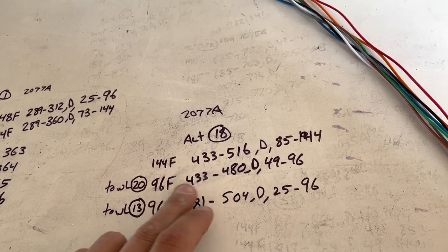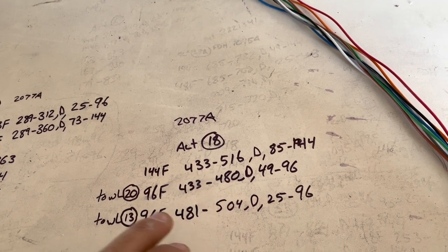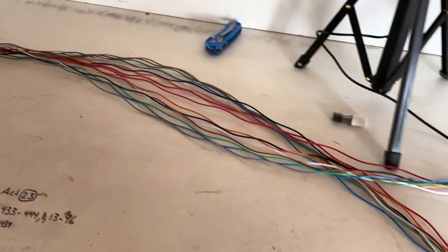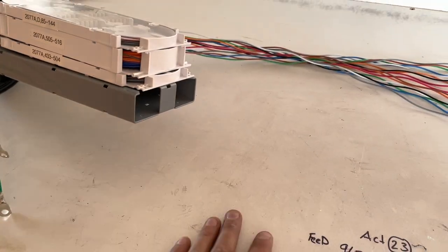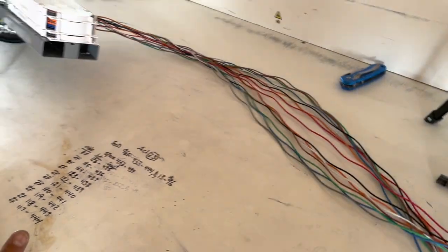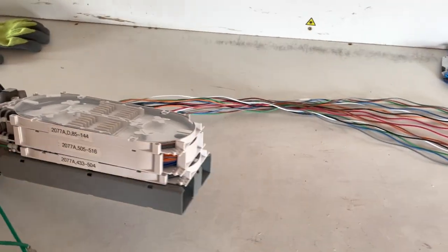So within this cable, we're gonna be using blue tube, orange tube, green tube, brown tube. This cable, we're gonna use the first two tubes, blue and orange. So out of all these tubes, we're only going to be using six. The rest of the tubes are all just going to be dead and put within the basket here for the future if needed. All right, we'll go ahead and show you how I enter these into this case and get them all ready to be spliced.